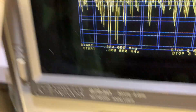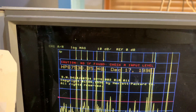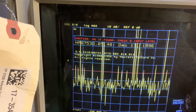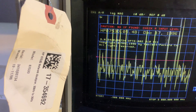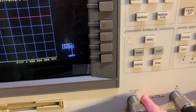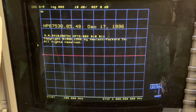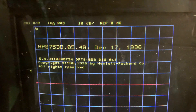Looking at the front panel, we see the message 'No IF found, check R input level.' The reason for this is that the R channel locks to the source, and since the R channel isn't receiving an RF signal right now, it won't work. So I'm going to put a jumper cable between the RF output and the R channel input, and we can see that the error message is now gone — the unit is locked and everything works fine.